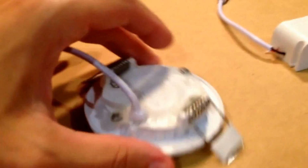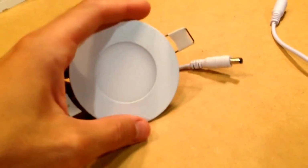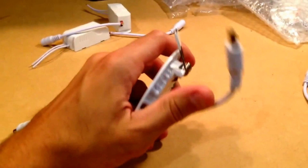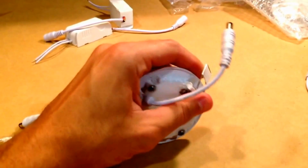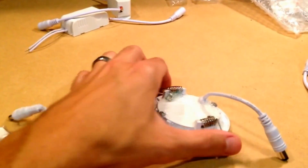This one is a finished one, and you can see all this junk all over it. It's just clear silicone. After I put the ears on, I sealed this edge where the metal panel meets the body of the LED panel, and then also I sealed around the grommet where the wire comes out, just to give this another added layer of protection. You can't tell from the front side that it's silicone, but it's in case there ever was to get water in the soffit, just dripping, maybe say from ice dams. I've never had one, but in case that does happen, this is in there.